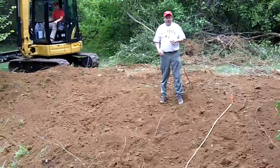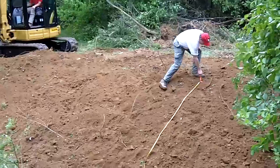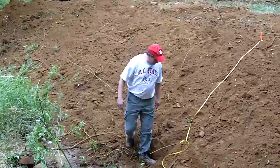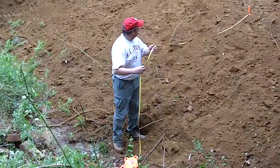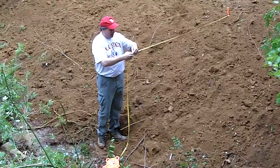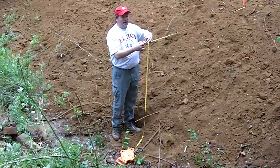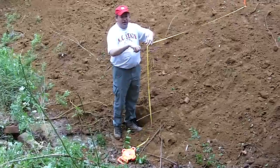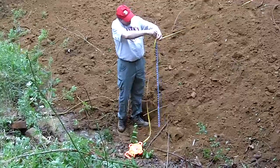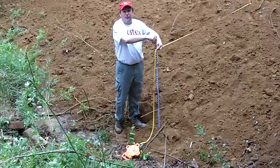Joe has already started the grading, and I'm going to come back and check on his slope. I have pinned a tape here at the top of the bank, and I come across to the bottom of the slope here and pull that tape. I find that horizontally across to this edge of the stream, we're at about 11 feet. 11 feet on a 3 to 1 slope means that my stream bank height would be around 3 to 4 feet, and I take a pocket rod here and find that indeed my bank height is just below 4 feet.